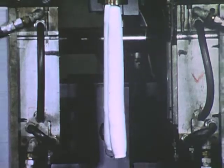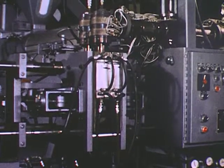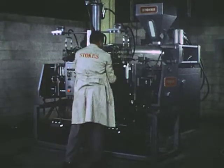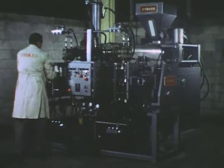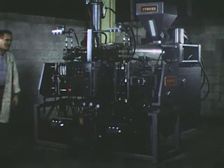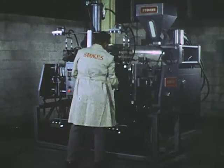Here, the left-hand mold opens and finished bottles are removed. Now the valve rotates and the parison is delivered. The mold clamps shut and cooling begins. With the valve in a neutral position, the reciprocating screw returns to its full charge position. The extruder valve shifts and plastic material is delivered to the right-hand mold. At the closing of the mold over the parison, the screw again recharges.